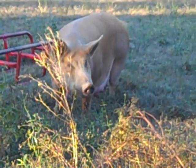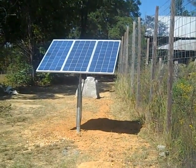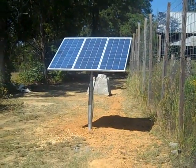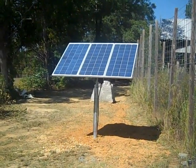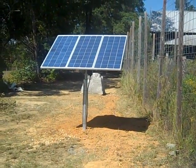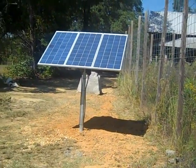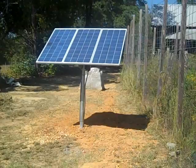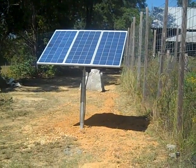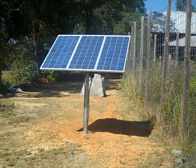They're awfully big, ready for some little piglets. Engineer 775 — this is probably the most complicated system I've done so far. It doesn't look that complicated, it's pretty small, but on this site it's helping out with some livestock. We're completely off-grid, using two panels to pump water out of a well. There are two wells on this site and five pumps: a hand pump, two grid-tied submersibles, a submersible solar pump, and a booster pump from Dankoff Flowlight.